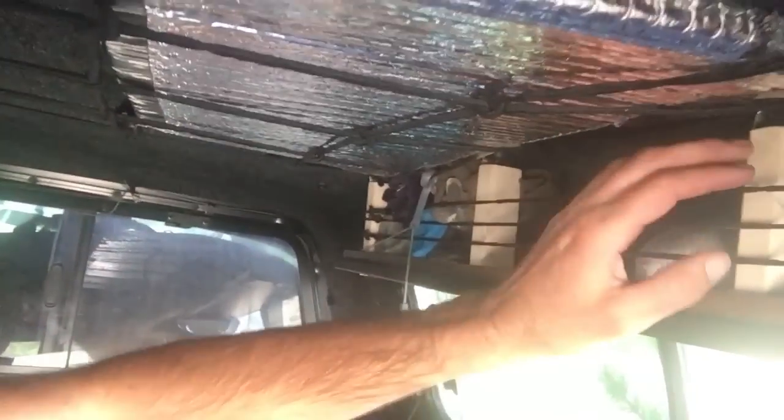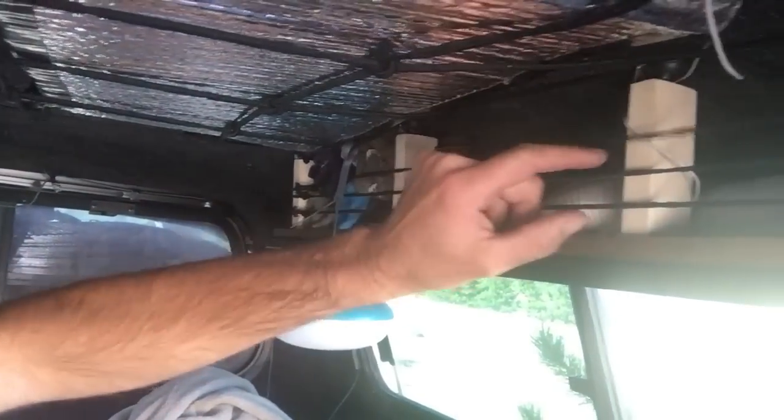When I was making this, in order to make sure that it was really solid, I attached this underside here. There are a bunch of screws on the window that hold the window into place. I took those screws out and used L brackets again, and I bent them to a 45-degree angle to hold the 6-inch plank here. This is a piece of aspen wood on the underside, and the reason I used aspen is because it's super lightweight, but still pretty strong.